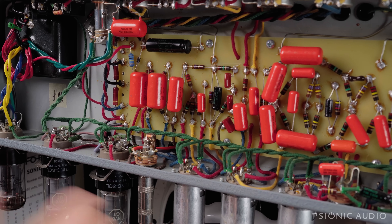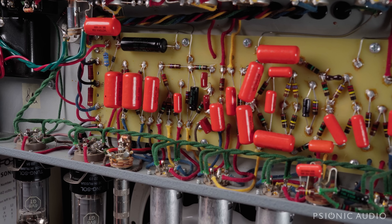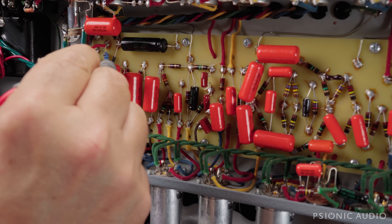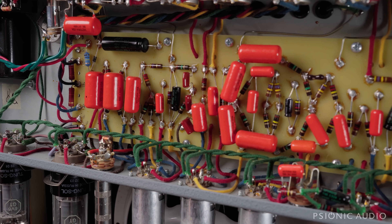No mechanical noise. Sometimes, like you heard on the Princeton earlier, when a tube goes bad it gets very sensitive to vibrations. Let's check and make sure the grid isn't drifting. There are two causes of grid drift in an output tube: a leak in the coupling cap of the preceding stage, or internal leakage from screen-to-grid or plate-to-grid within a bad tube. This all seems good. The amp came in and went out with the first pair of these tubes, and the owner ordered a matched quad, so the second pair should have the same current draw and would not need re-biasing — but let me triple-check.